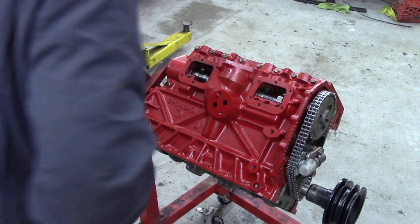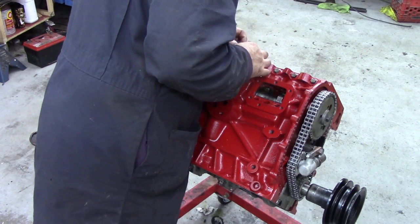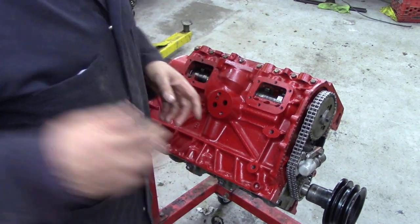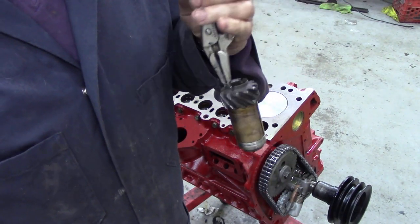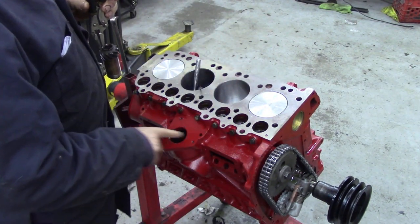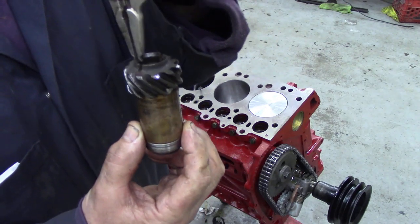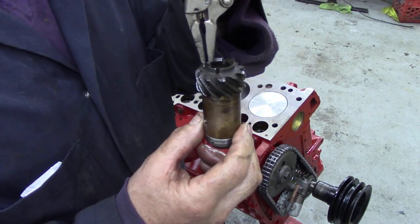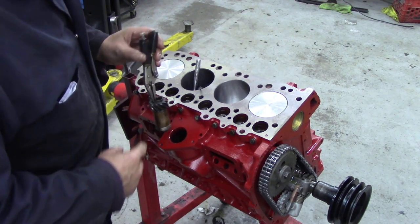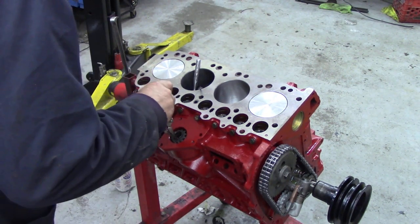What we've got to do is work out where this is going to end up when we drop it in. I'm going to insert the gear with a pair of locking pliers so I can see directly opposite where the tang is. The main drive has to be at 20 degrees. The tricky part about this is when you put it in it's going to screw down, and this little chap here moves out of the way. So even though you think you're going to put it in at a certain position, by the time it turns, that little hole will have moved. We've got to try and compensate for that.